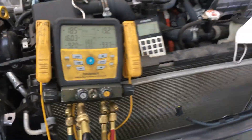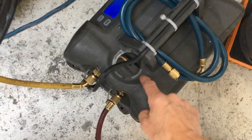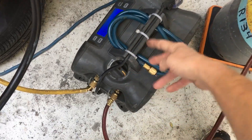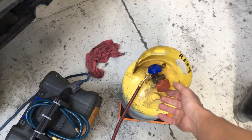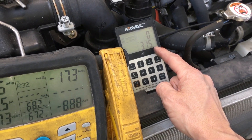It did jump, so something just purged. I'm also going to do a clean-out of the coil — a self-purge. Going over to self-purge. Now it's taking the liquid out of the coil, pumping the liquid into the tank. You can see it jumped up to over 300 grams.